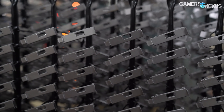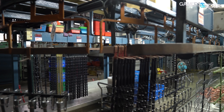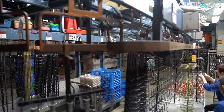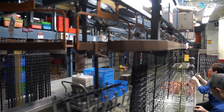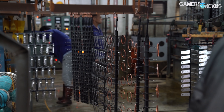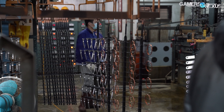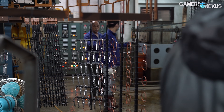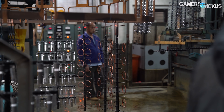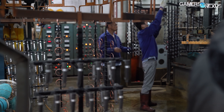Rack plating is more expensive and laborious than barrel plating, but it offers better control over the finish of each individual part. Rack plating is better suited to large, fragile, or complex items as well as decorative items, since it offers precise control over rack marks — points where the coating is missing due to contact with the metal rack. We spotted VGA slot covers being plated at the time of our visit, but this factory also rack plates PCIe expansion slot covers like for network devices, motherboard trays, and various other case parts for companies including Lian Li.